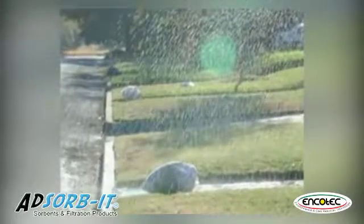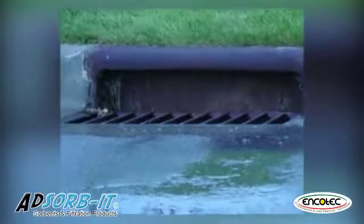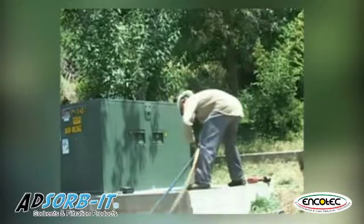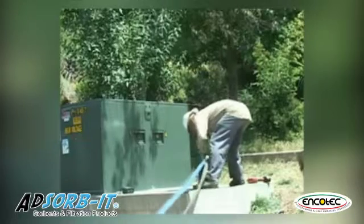Within Southern California Edison service territory, there are nearly 400,000 underground vaults. These vaults are often filled with water, as most Edison crews know from experience. Water may collect due to landscape irrigation, stormwater inflow, seepage, or from groundwater or adjacent storm drains. Prior to performing any maintenance or equipment installation, these vaults must be dewatered. Safety requirements demand nothing less.